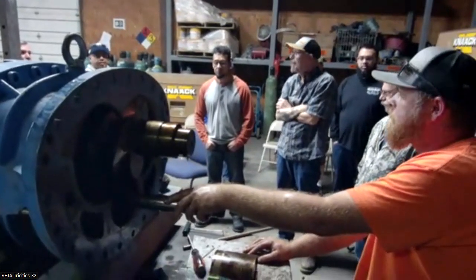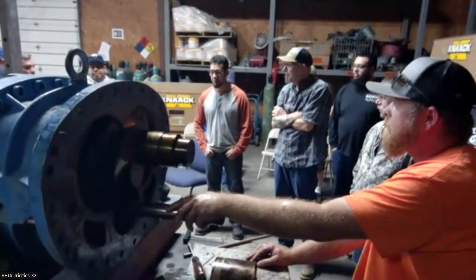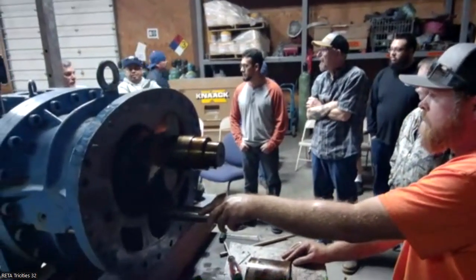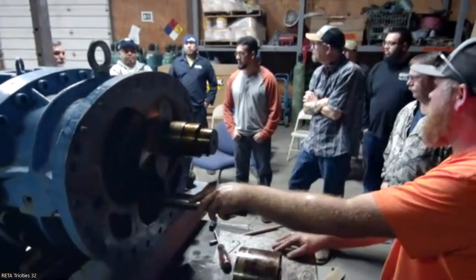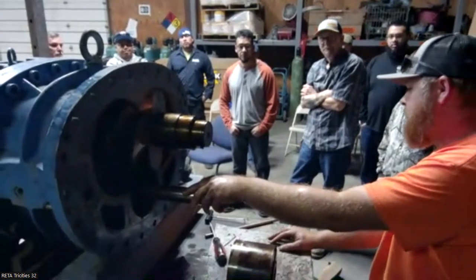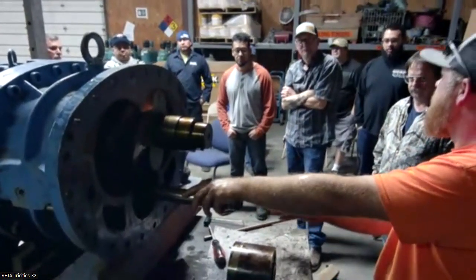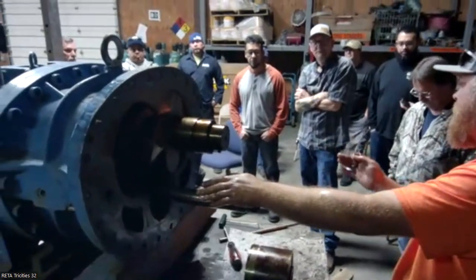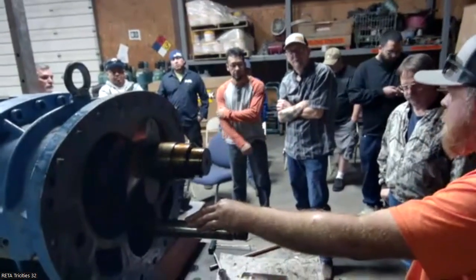So it's about the technician that takes the analysis, and it's about the guy that reads it. Depending how loaded your compressor is, all of that matters. Especially if you're doing vibration analysis annually or biannually, it doesn't matter, you want the same condition every time, because you're basically trying to establish a trend. So if you start a baseline at 100% load, the next time the guy goes back in at 40%.